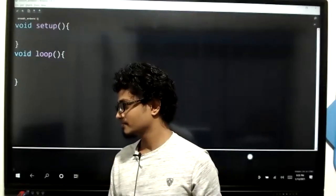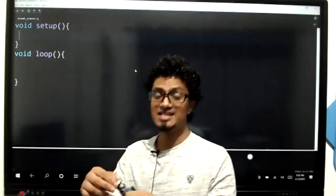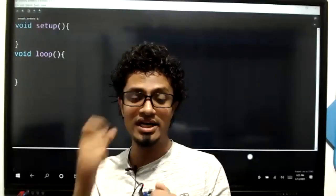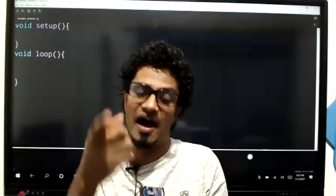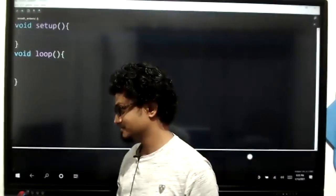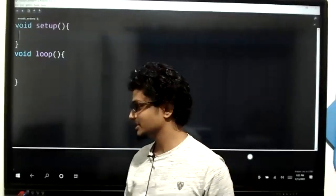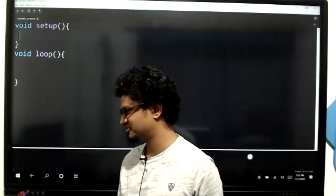Very simple. Look at the sensor. There are some captions there. Labels are there in front of the pins. DO digital out is there. GND is there, VCC is there. Not the plus and the minus, not the VCC and the GND, the other pin, take it and then connect that line to pin number 2. AO is also there. Don't use AO if you have that. Just use DO. That will be enough.